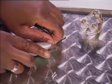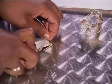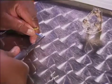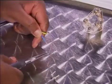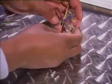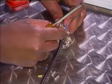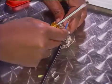Expose a small portion of copper wire in each wire, using the craft knife and pliers to score and pull. Twist each bunch of copper wires to make sure they stay together. Feed the whole cord through the cord grip. Feed copper wires through the holes in each terminal in the correct way.